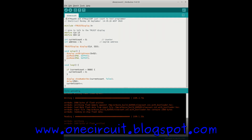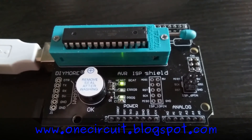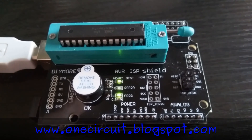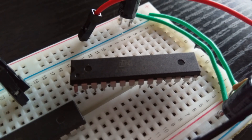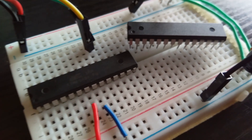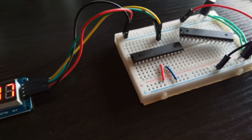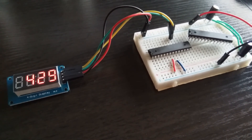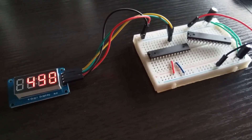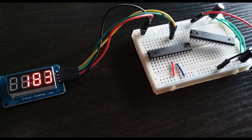Now the only thing that remains is to see what that compiling looks like live. There it is - that's the 8A with the code loaded up fine. The 328P has been in and is working fine, and the 8A is sitting in position with the seven-segment display counting every quarter of a second. I can simply swap the 328 back in and it does the same thing - proof of concept, both chips work.